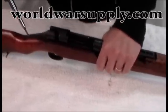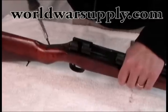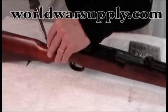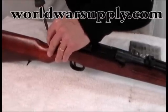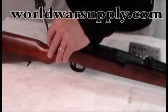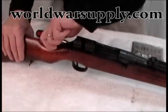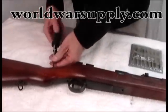Turn it over and work this screw out here. Sometimes screws need a little persuasion. One way to accomplish that is to put your screwdriver in the slot, then take a pair of channel locks and grab the screwdriver to help turn it. Sometimes it helps to have another person. But it's always an option if things are a little bit stuck — hold it down and use pliers to turn the screwdriver to get things out.